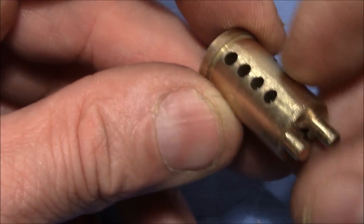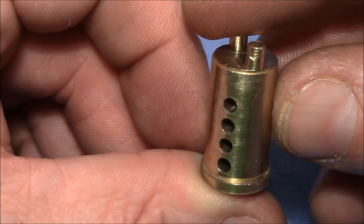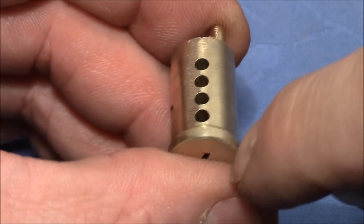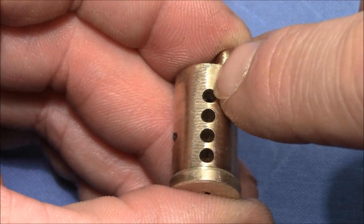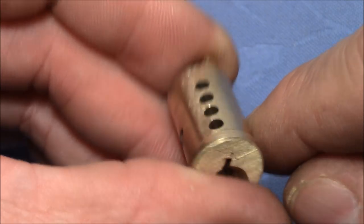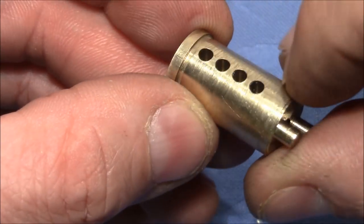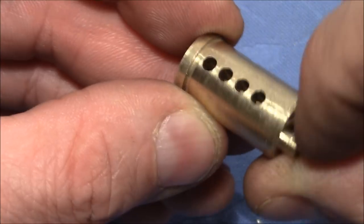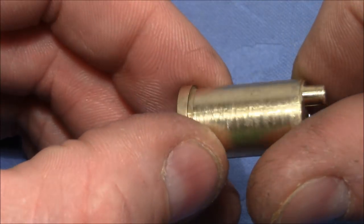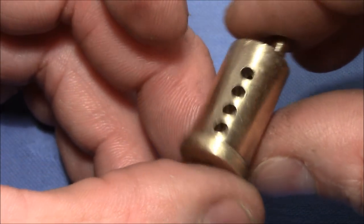and to the plug. You've already seen how ugly this plug is made. You can see the deviation of the pin or the line for the chambers. It's not a straight line, it's bent. And it's not smooth, it's like filed with a very rough file. That's a very ugly plug.